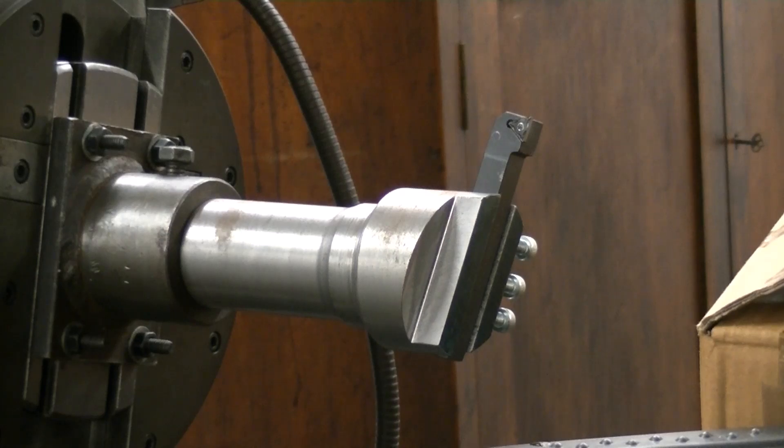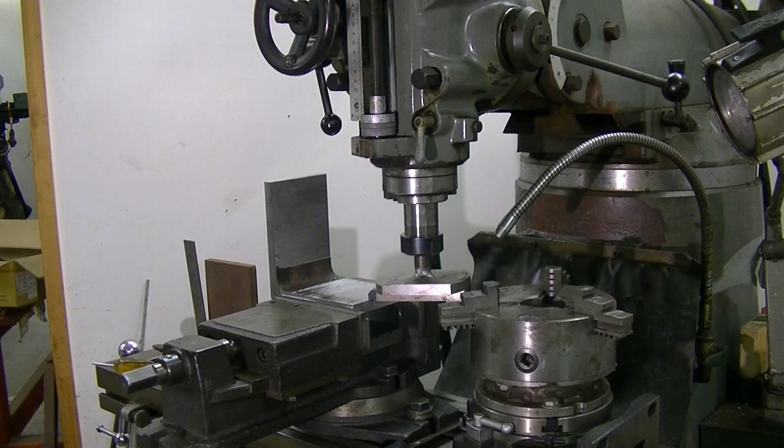This is the HBM extension bar that I built in the previous episode, and that's the left-hand tool holder I'll be taking out of there and putting into the fly cutter. I'll bring you back when the fly cutter is ready to go. Well, here we are back on the mill. I applied a little bit of gooey goop on there — I don't like spraying oil everywhere if I can avoid it. Only taking about a thou and a half cut, so we'll see if it works.